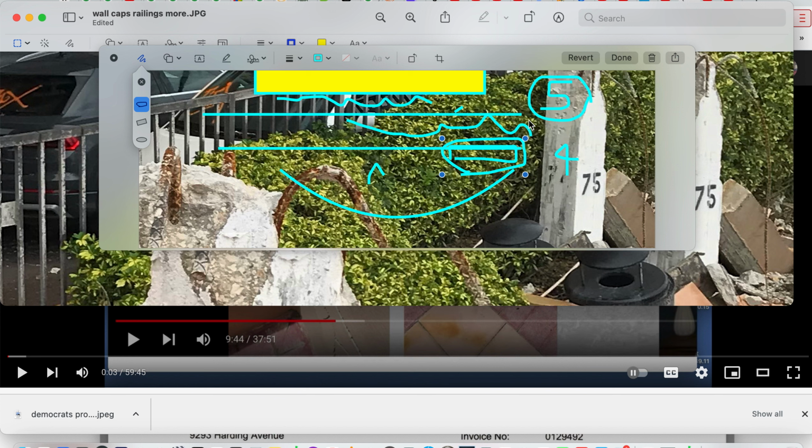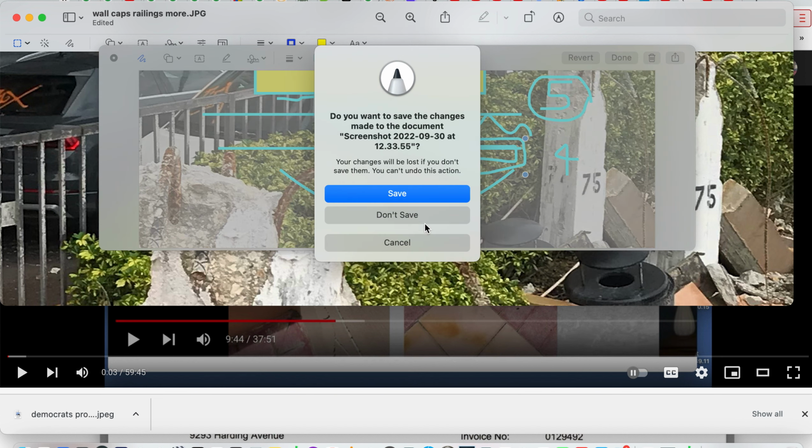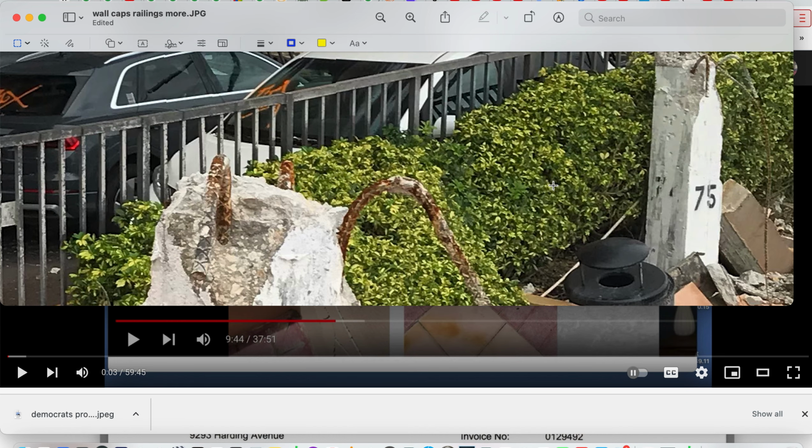If it's got shear links in it, it's going to be different. If it's got stirrups in it, it's going to be a different failure than the one I just showed you. If it's just top steel and bottom steel, it'll sort of fracture like that. All right, you can question me on that. You can say, "Oh, I see what you did there," but I think it's more this. I'm totally open to that.